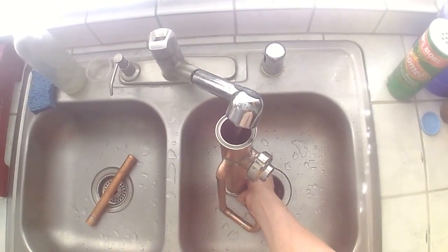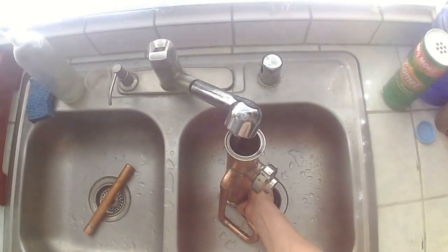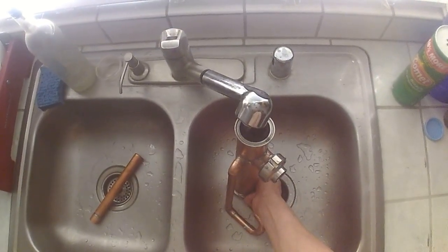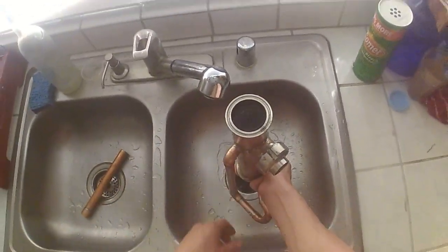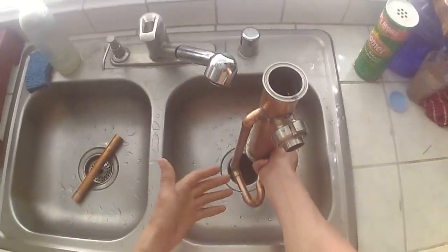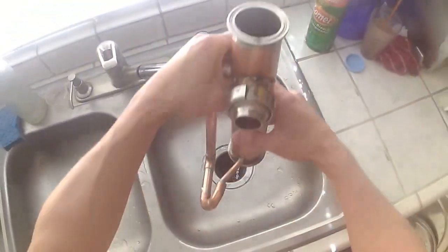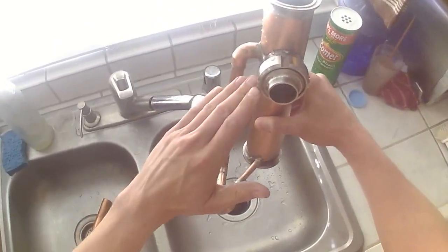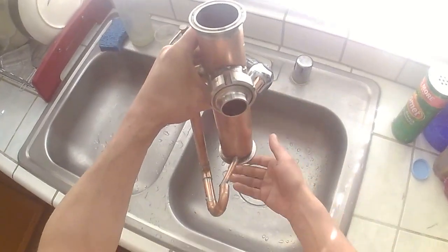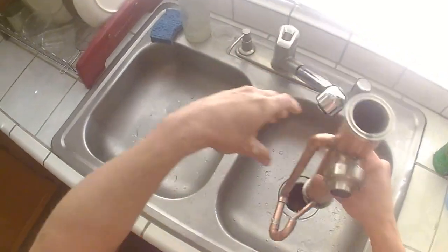You can use this thumper as a gin basket if you want — you could put copper packing into it, all of those things. Once it's filled up past the drain, it will start to drain out. This will prime the drain pretty quickly and once that happens, you can let it go. Now your thumper is going to be filled up to here. I prefer it this way — it gives you more length of fluid for the bubbles to pass through coming out of your column.